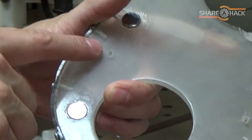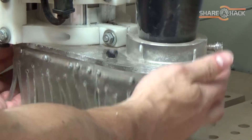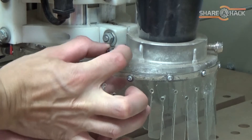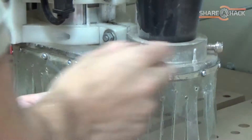You can see here I drilled and tapped two holes for two thumbscrews to help secure the shroud to the top piece so it doesn't get yanked off during a cut. If one of the flaps gets caught on a sharp edge or something, the thumbscrews will help to hold it on and it's not just the magnets holding it together.